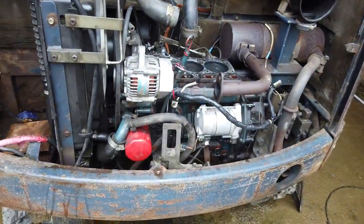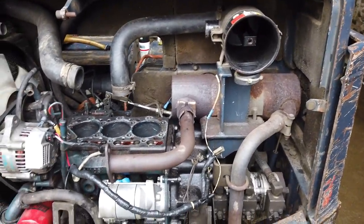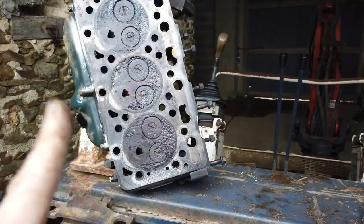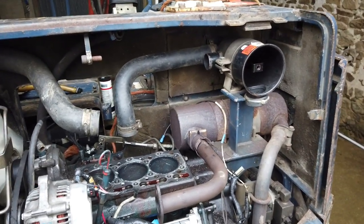Tyler's been here helping — he's doing his training module on engine strip-down. We had quite a good time, although there's a lot of diesel and a lot of working underneath. We had the sump off and got the pistons out. We think the primary cause of the head cracking is overheating, probably due to the French farmer using the digger in the summer.